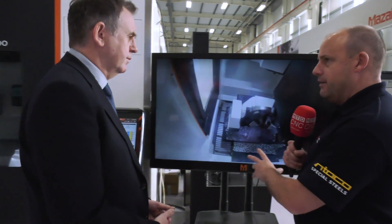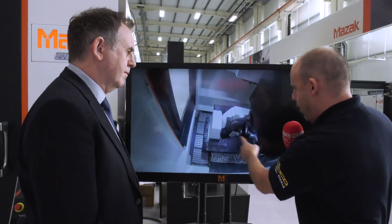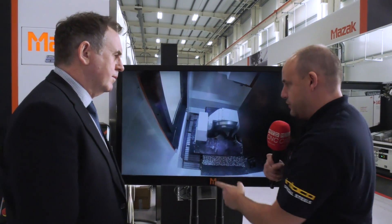There are a few things we're going to touch on now. I want to explore this — it's a great visual for the camera. This is inside the machine. The door is here and the Y-axis is moving in this direction as you'll see. The advantage of bridge-type construction is high rigidity, and from that rigidity we gain high accuracy. Using the bridge, we can move the table on the Y-axis underneath the bridge, which reduces the necessary floor space and makes it a very compact machine. It also reduces the number of axes stacked up on one platform.